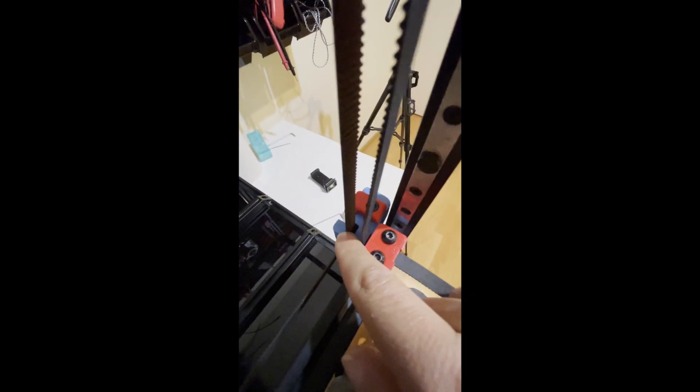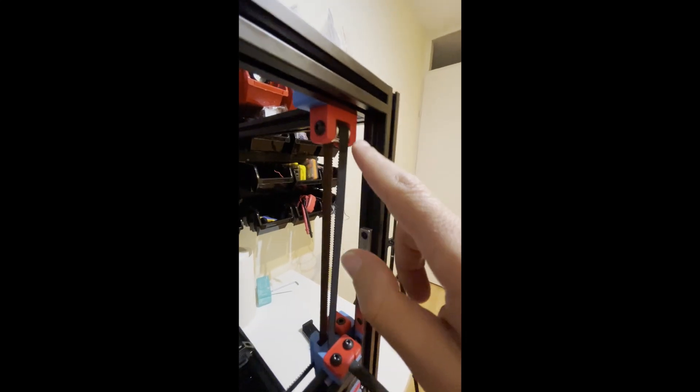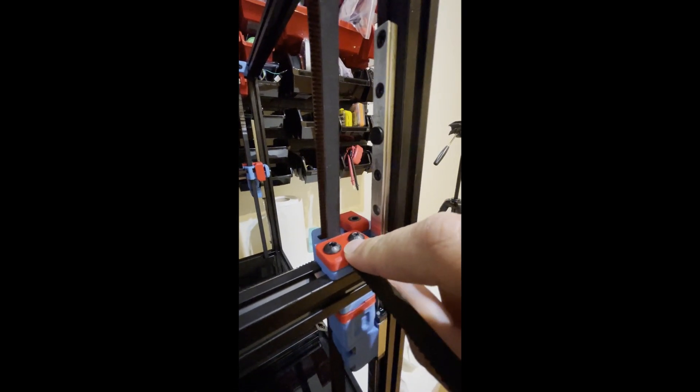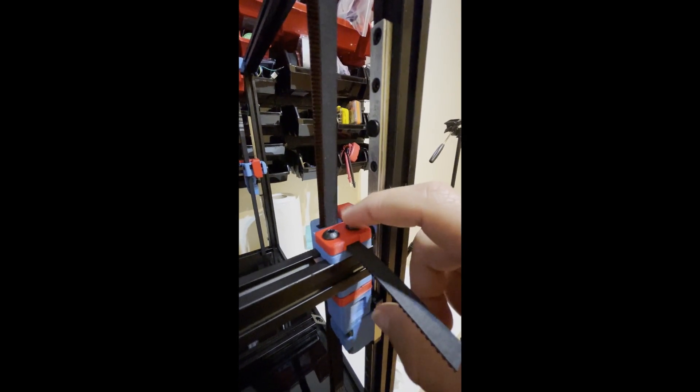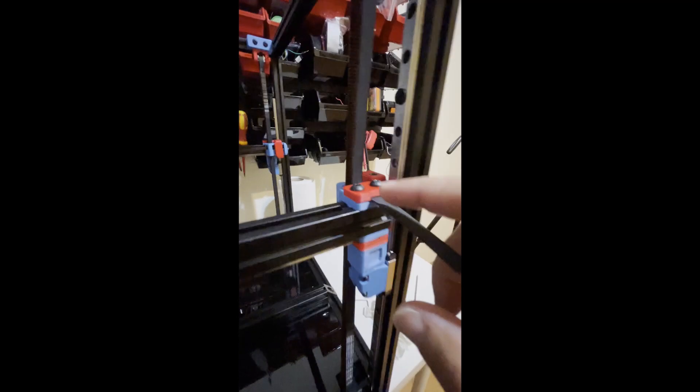You are going to the pulley, coming up from it, and using this channel for the Z belts. You go to the idler and come back to your front idler, and on top you are securing your belt via this cap. I didn't tighten these caps for all of them — I didn't tighten my Z belts yet. You can do the same thing for all four Z belts.